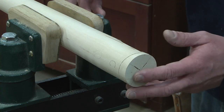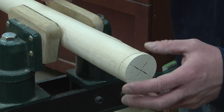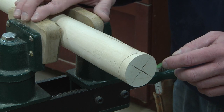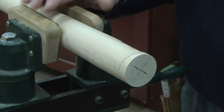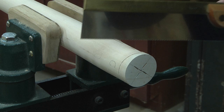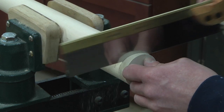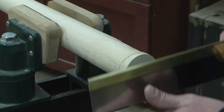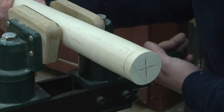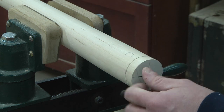So trying to cut the leg in the table, dry fitted together, it was just wiggling around on me too much, so I took it all apart, got it clamped up here in the vise. I already have my mark, and I've slowly been sawing on it, and I'm not starting the saw and trusting myself to go straight down. I'm sawing a little bit and rotating, kind of working my way to the center.